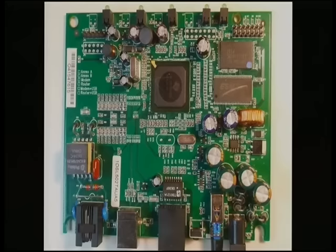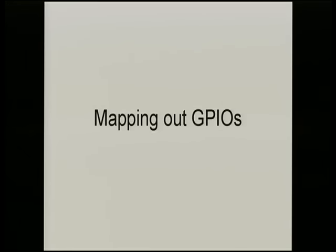So the other thing I could tell from the kernel source, which is available, thankfully, although it's a bit of an uphill battle with some of the vendors, but the LEDs at the top, they're driven using the GPIO framework in the kernel. So I know they're GPIO pins there. They're blinked on and off in software for network, heartbeat, that sort of thing. So it stands to reason that the empty spaces are also GPIO pins. So cool, I can use those. I just need to know which is which, so we need to map them out.